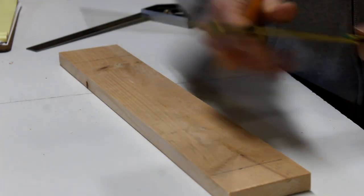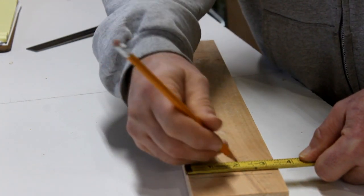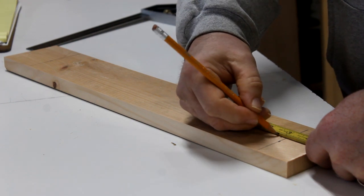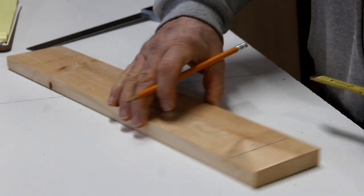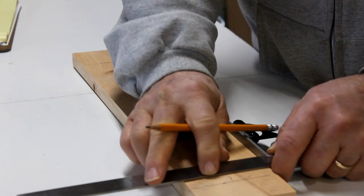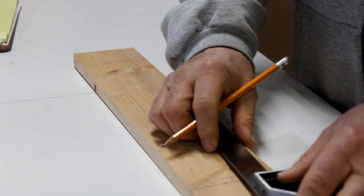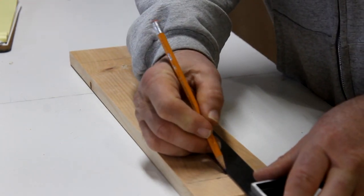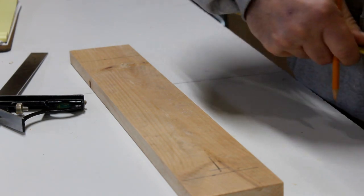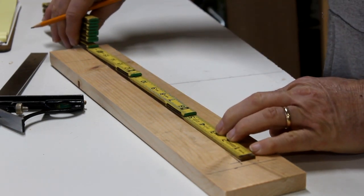So I'm going to put a dowel on one end, right about in the center, roughly. It doesn't have to be perfect, but sometimes I get a little anal about that stuff, so I just want to locate it. And I'm using some line that's about 3/8 of an inch, so I'm coming back about 3/8 from that point, from the line that I drew previously. And I want my center right here, center line. I'm going to use a 3/8 inch dowel, and this gap that I just drew is going to be the outer edge of the dowel.